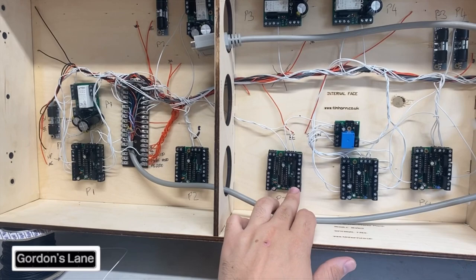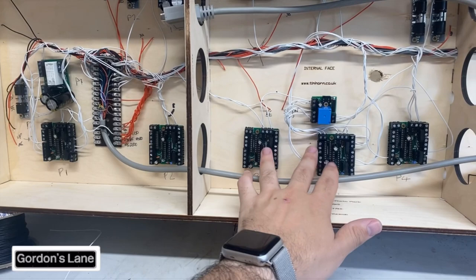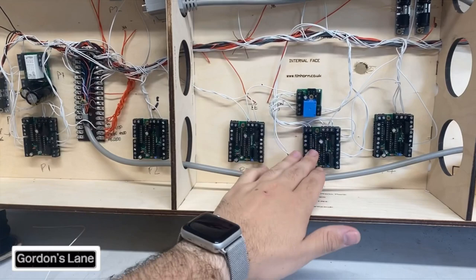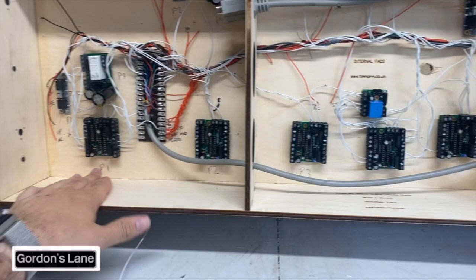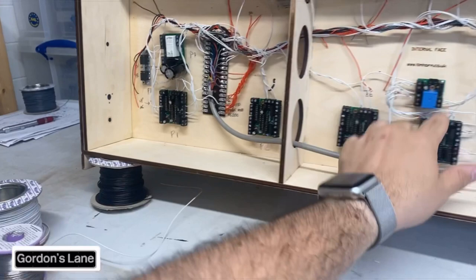Now, these here are the ACM, which is the aspect control modules, and this is your ATP. What these do is they actually talk to the point control modules, they talk to the track circuiting, and they also talk to the signals. So as you can see there, that's point 1. That talks to that, which gives information to there, which then talks to point number 2, because they're the same ends. They then talk to the signal, and the signal then will talk to the next signal in the rear.